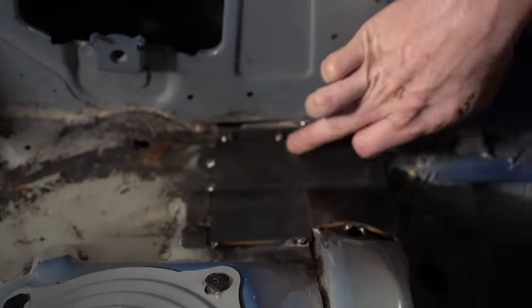It makes it a lot easier to line the tube up beside the box. You can scribe with the marker, take over to the bandsaw, cut on your line, and with a bit of experience, I can get it every time, but you'll get it super close where you just need a little grind and you'd get it perfect. Let's get some backstays in.